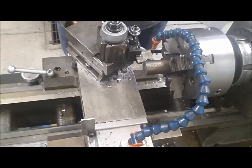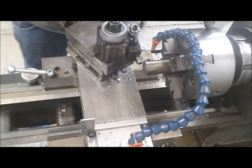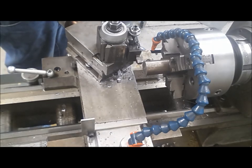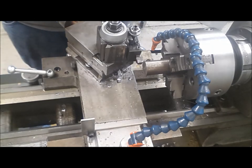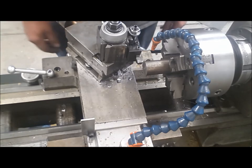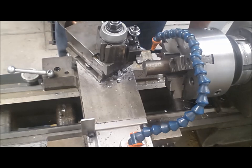I don't recall what size Adam and Tom are using, but this is going to be for the low horsepower category. This is a one horsepower machine — it's a Logan 2555. You usually use these with collets and use it for a speed setup, but I got a three jaw in there now and just cranked down on my part. This machine actually has a back gear, so I got it in back gear and I got my torque boost set on my VFD. Mind the back gear — it's a little whiny.